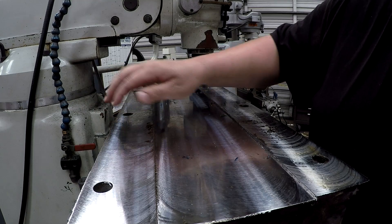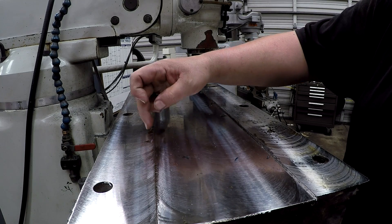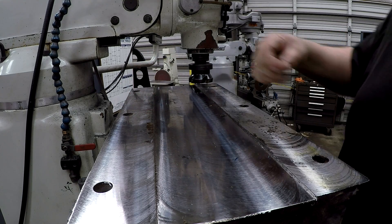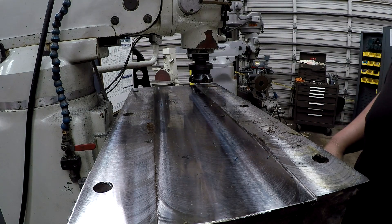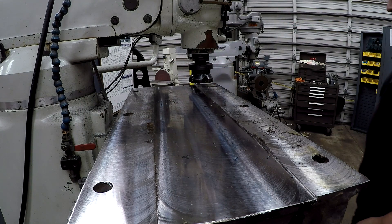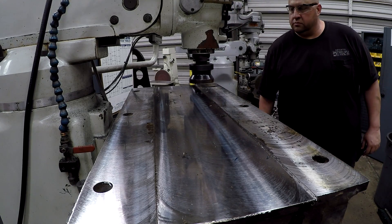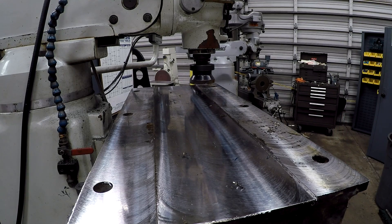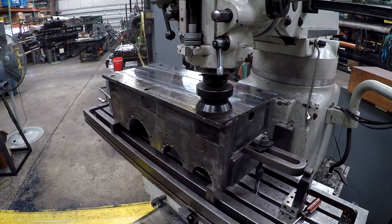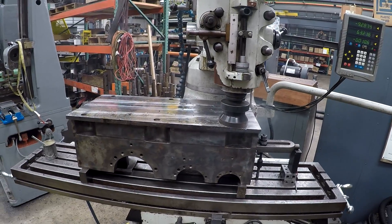We made our finished cut over here — that's just cut in oil, I haven't cleaned it yet. We've got this side oiled up. We didn't fully clean this up, but these pits are pretty deep and I think this is going to suffice plenty for what we need. They told me it didn't have to be 100% clean as long as we've got good solid contact for all six of the mounts. We'll take a pass down this side and we're going to be good to go besides some deburring.